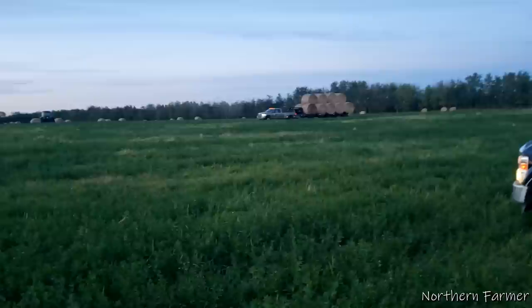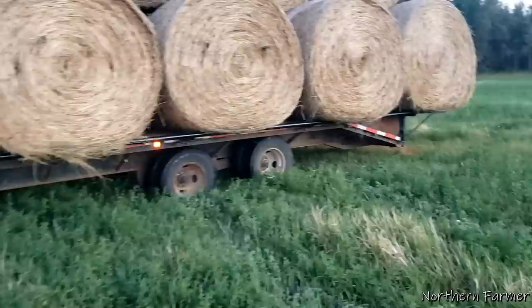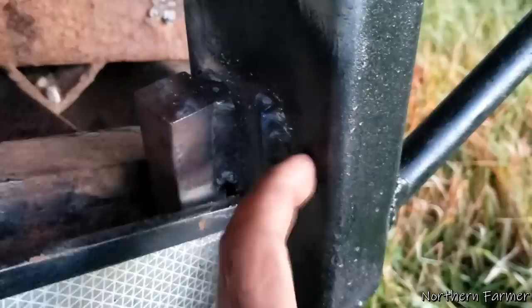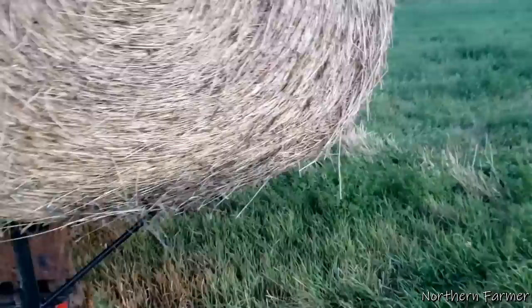Got another load on - Sean just finished loading me, he's firing up his truck. Anyway, that fix did her good - she's staying straight now, she ain't going to fly out of there. This metal was too thin and it was actually sinking in there because this is not very wide, but she's in there good now and she's staying straight. So I still got to put a piece in the middle there to that hitch, and that'll keep her from flexing there too.